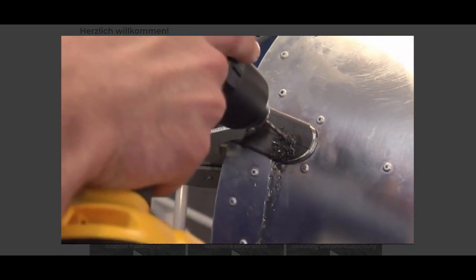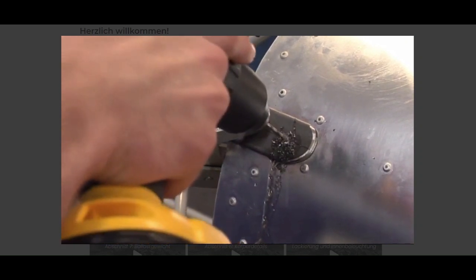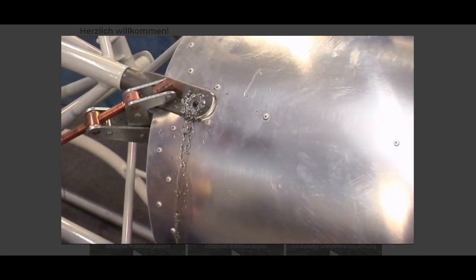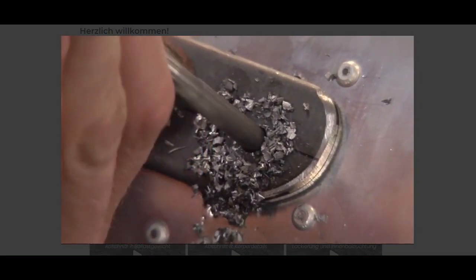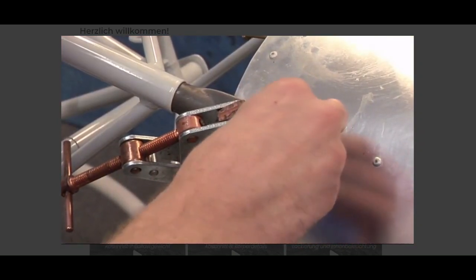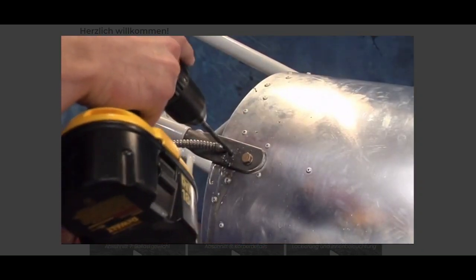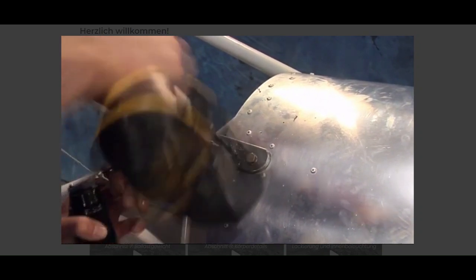Start with a pilot drill bit and then open the hole with a letter D drill bit. Use a letter D reamer to final size the hole. Note, it may be necessary to use extra washers on the 1/4-inch bolts to prevent the nuts from bottoming out.